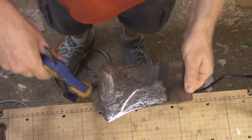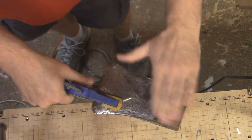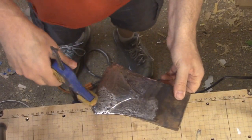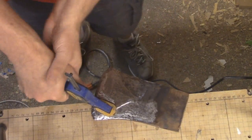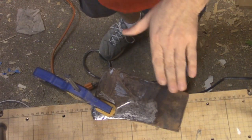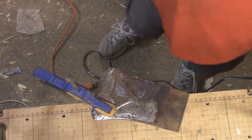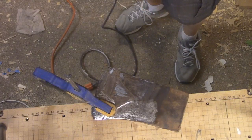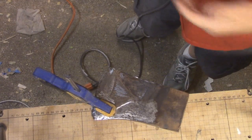This section right here — this part I'm not worried about, it's not pitted, it's okay. The same is true on the opposite side as well. What I want to do in these hard-to-reach areas is come in here with the grinder and take that stuff off. I'm going to take this over to my belt sander and try to shape a lot of this. I don't think I'll be able to get all the pits out without removing a whole bunch of steel, but if I can remove a lot of them, that will be cool.